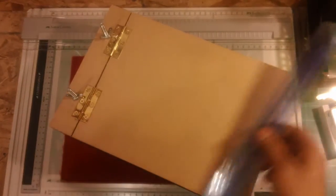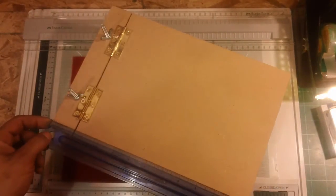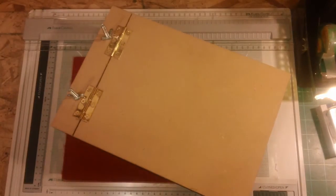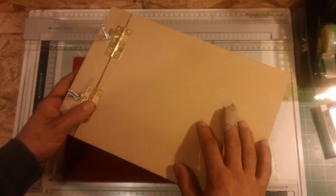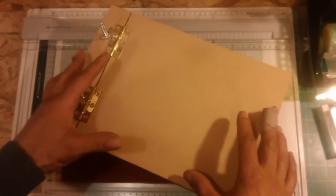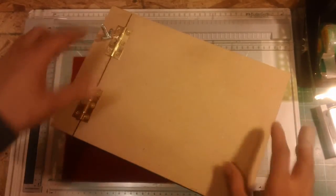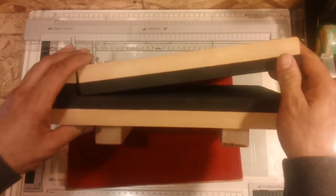This smaller press is about eight and a quarter by eight and a quarter by twelve, and the actual pressing area is going to be eight and a quarter by ten and a quarter — so you've got a substantial amount of size there. Now I went with the hinge system, but the problem with the hinge system is that you're locked in at the back, and it was always an issue — if you have things that are uneven and you want an even press, being locked down in the back means you're going to have more pressure towards the back and it's going to angle upward.